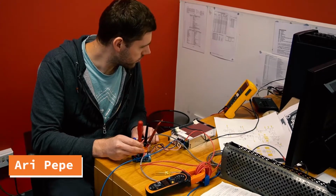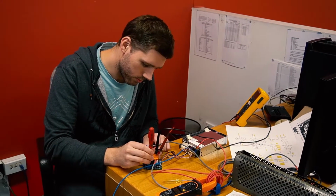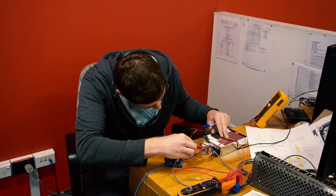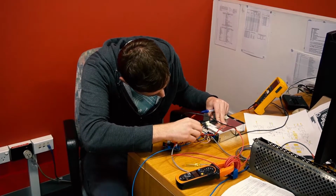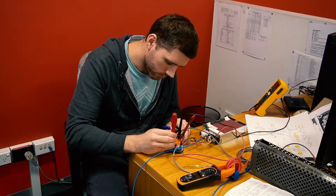First example, I was testing a PCB. It's requiring me to calibrate the current, so the current limit of the device, and setting the output voltage. And then testing it with the current monitoring disabled and testing it with the temperature monitoring disabled to see if it all still works.